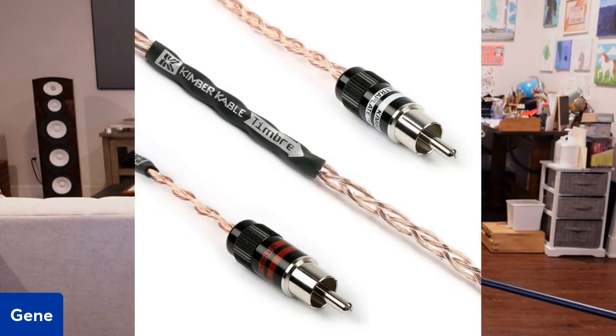When we're talking about cables — interconnects, HDMI cables — the directionality thing has some merit depending on the situation. I've got some twisted pair here from Kimber — interconnects. Twisted pair can come unshielded or shielded. The advantage of twisted pair is you get some good magnetic decoupling, so you'll see a lot of twisted pair used in phono preamps — it's good at rejecting magnetic noise. Sometimes you'll see a shield on it, and in many cases they only tie the shield on one side and leave it floating on the other. Personally I'm not a huge fan of that approach. The argument is it eliminates ground loops, but if you set up a system really well and get all your ground paths correct, there should be no reason to only tie the shield on one end.